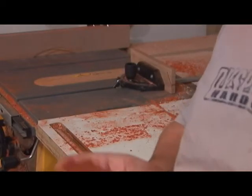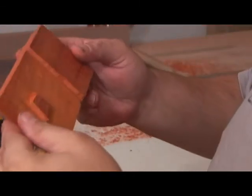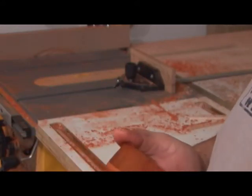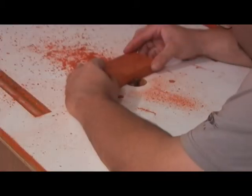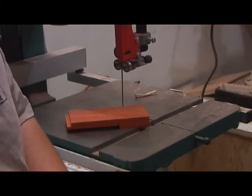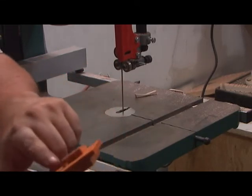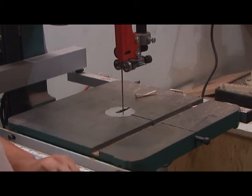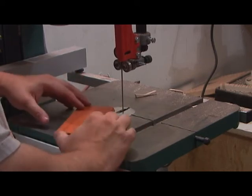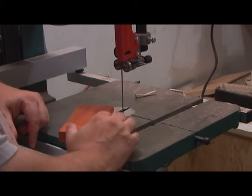Routed one pass — kept a little bit right here just to give support when I go to cut it out. Once I cut it out I'll come back here, leave this all set up, and knock it off. I'm going to make the second pass. One of the reasons I left this little piece on is it'll help support the block as I go to the bandsaw, and it will be real easy to knock that off when we're done. I'm going to go ahead and bandsaw this out, staying proud of the line. I'll shape it and do what we need to do.